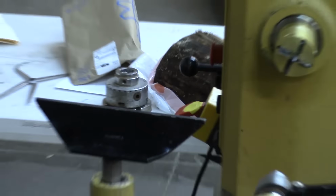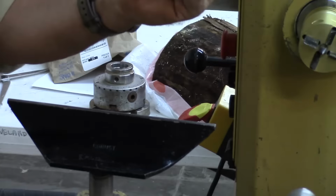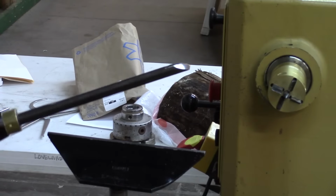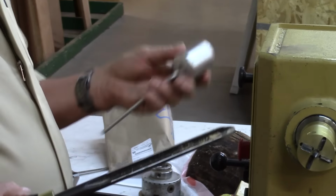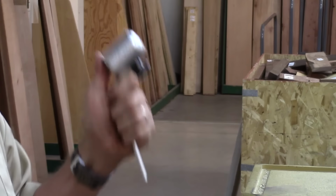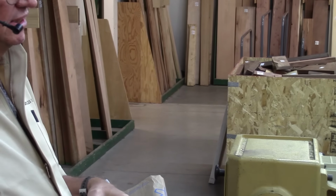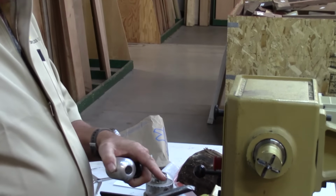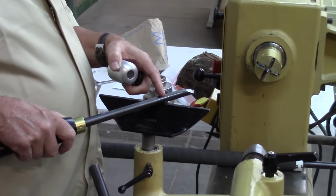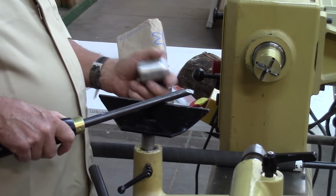Now, what angle do you have on there? What's the angle that you use? The angle of the bevel here is 60 degrees. Yeah, steep. Right, 60 on the nose. But the wings are a lot sharper. Yeah, and they're nearly flat. This is his jig, and it works on a Wolverine system. You basically have to have this jig to go with this gouge to sharpen it that way. And it sharpens correctly because this particular gouge is a true parabolic flute. That's what makes it a nice even edge all the way up.